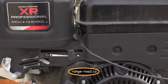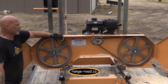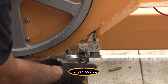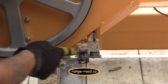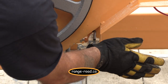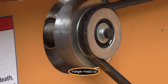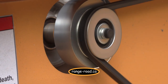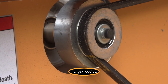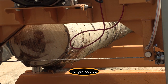It's driven by a 13.5 horsepower Briggs & Stratton engine, and I ran a whole day of cutting on a single tank of fuel — pretty impressed. The blade is controlled and held in place by blocks on both sides, plus a rear bearing wheel so that back-push can't cause it to twist or warp. This uses a centrifugal clutch, which means you start under no load. Nothing turns at the front end until you up the RPM, then the centrifugal clutch engages. It's great for cold-weather starts and reduces wear and tear when you're idling between cuts.